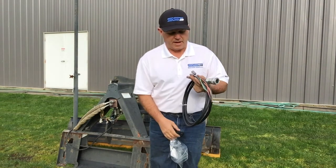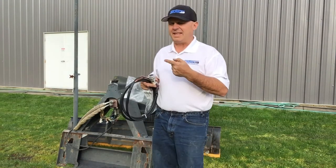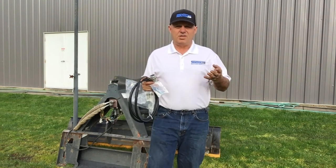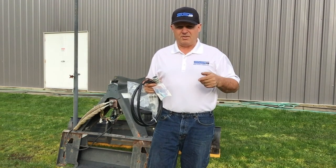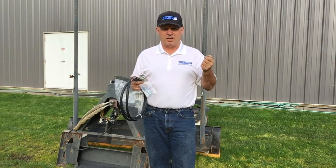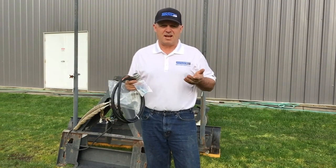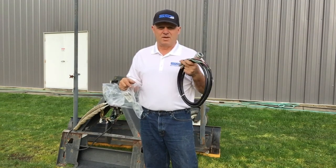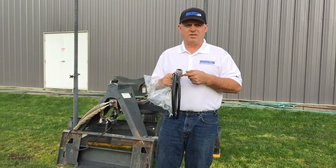This is the standard harness with six outputs and a 14-pin. The 8-pin only has four outputs, so you won't be able to use it on the grader. Old Caterpillars — C series and prior — did not have enough buttons; you only have four controls. A grader takes left blade up and down (two controls), right blade up and down (two controls), and angling the blade left and right (two controls) — that's six controls total. You also need a locking button if you're going to run the laser receivers. This grader is equipped with laser receiver booms, but this harness — just our really inexpensive one — will work for basic grading. If you do want to run the lasers, we have an updated harness with more outputs for that.